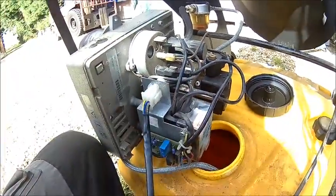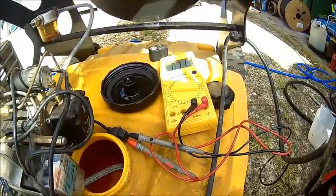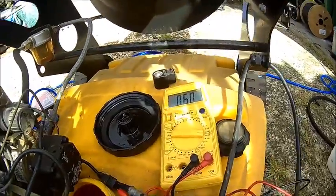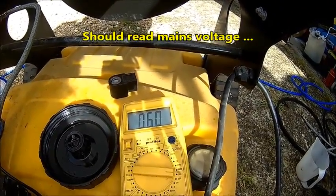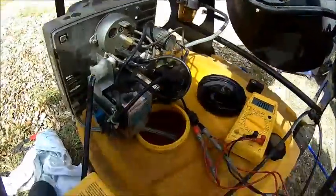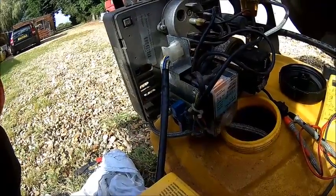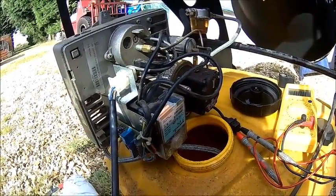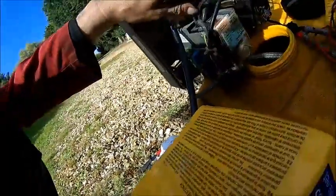Only takes a minute to find the fault. I'll put a meter on the output to see if anything is happening. I'm getting 60 volts on the coil — that's not enough. We have some electrical gremlin here. We have no voltage on the coil. The coil resistance is good at about 2 kilo-ohms, so that's fine. For whatever reason we're not getting a clearance signal to the solenoid. The wiring seems correct — this is the solenoid, and the ground is down here. So the possibility is that the controller is shot because it's all cracked.